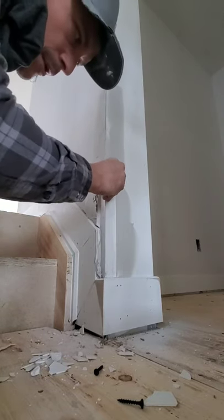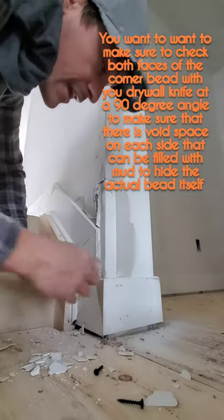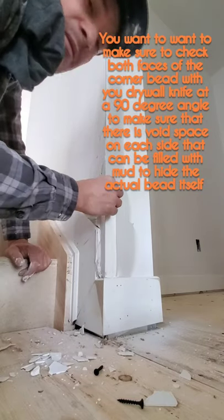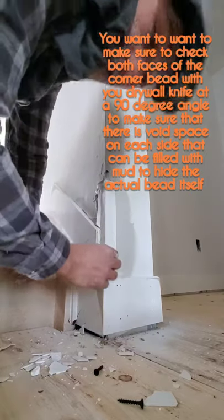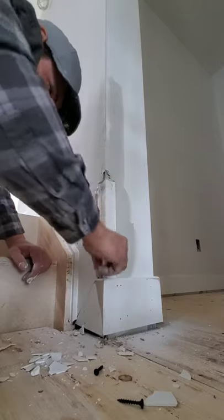And this is the critical part where you always make sure your points are lined up. That's one thing I can't stand is when you go and do a job and the bead guys have laid points over, sometimes almost a quarter inch off, a half inch off, and you say, how am I supposed to blend that in? But you do it anyways. You do it because you're paid to do it. It's extra time.